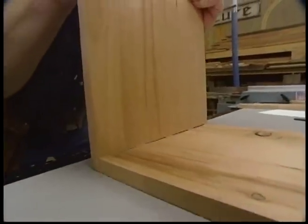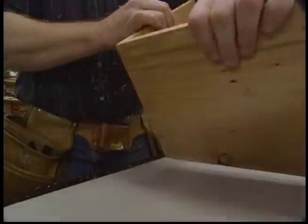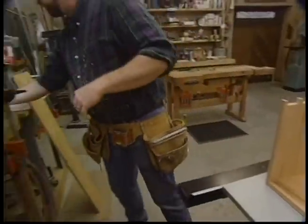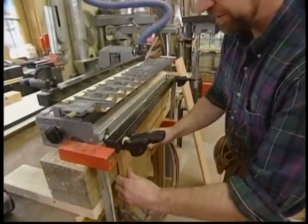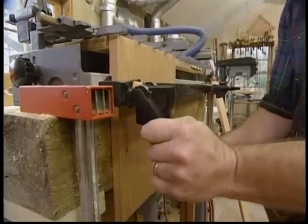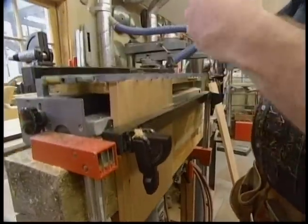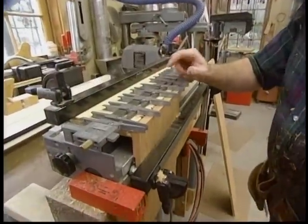Let's check the fit of the pins — that's pretty good. To make those pins, I mounted the end board in the jig with the front face, or exposed face, towards me. I've flipped the fingers over and switched the bit in the router to a straight cutting bit to excavate the material.